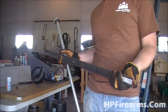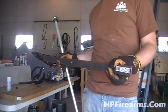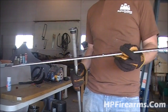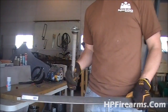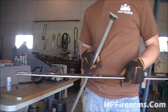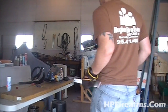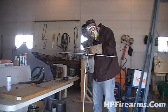This piece of steel is going to be our main support for our one-inch square tubing that we're going to use as our main boom. This is just a platform, and like I've talked about, we're building it in phases. This platform is going to be permanent to the spindle — we're actually going to weld it on here. Then we'll have our boom that goes on that is removable for maintenance. So I'm going to go ahead and get this welded on.